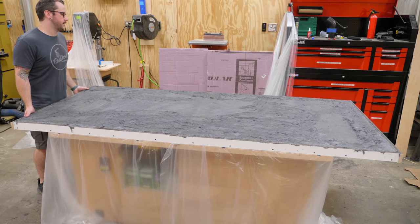With that, I could get masked up and started the arduous process of grinding the bottom of the table. I used a diamond cup wheel on my angle grinder — the same thing I used on the concrete guitar I built — and this thing cuts through concrete like butter. I started by removing the excess from around the edges of the form, then knocked off any sharp pieces since the last thing I wanted was someone to cut their legs when sitting at the table. I pulled out a level to use as a straight edge and started flattening the areas where I'd be mounting the metal legs, marking them out with a Sharpie so I didn't have to spend all day grinding. This all could have been avoided had I done some trowel work to smooth out the back face when casting — I'll definitely be more prepared for this in the future.